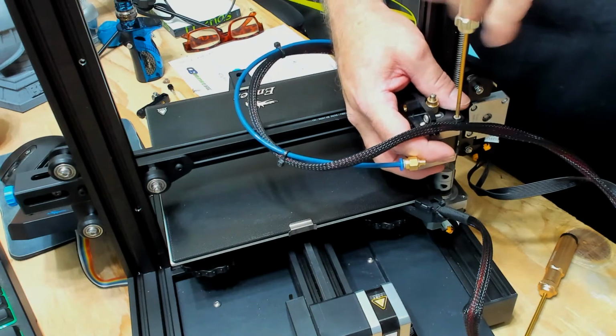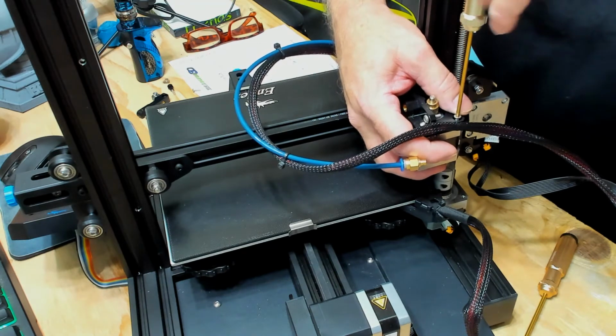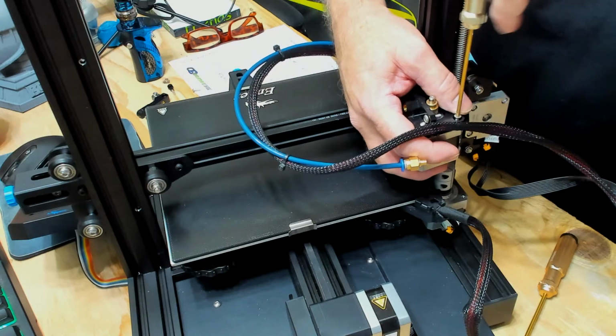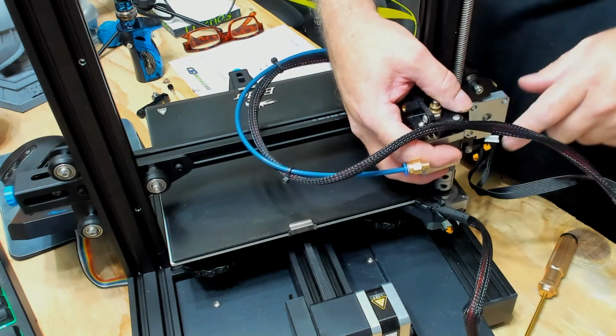My slicer looked like it would fit fine. But I got all the way to the top. The mask was almost done. And I looked like I still had another 1.5 inches to go. But no, I didn't. It ran out. So I dropped the model through the bed of my slicer on S3D all the way down to the very top and re-sliced it. I'm just trying to get it right so I can reprint it.